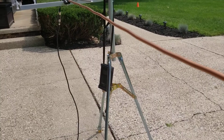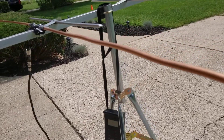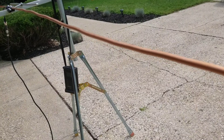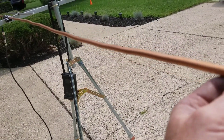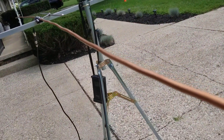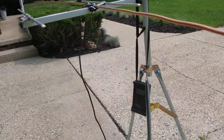I wouldn't make an antenna out of copper at all. Even if you did, this is going to corrode — you could paint it, but it doesn't matter, radio frequencies go right through paint. Some people polyurethane them; ham radio operators like to use copper. But I don't see why, because it doesn't produce a better result, it's heavier, it corrodes, and it's more expensive. Aluminum is still king when it comes to antennas.